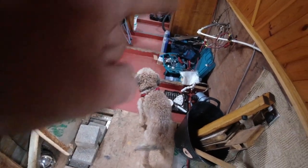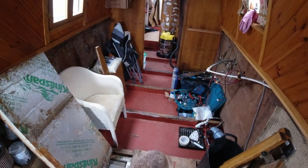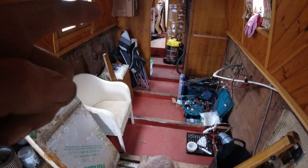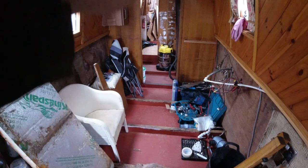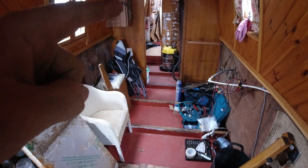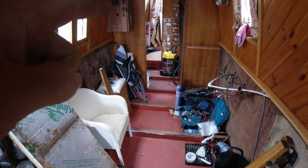All the way out, and then I'll have the air sucking in from the front and blowing out in the shower, because the shower room is going to be constantly moist. So that's the exit I want. So I want the air to come through and then out. And then what I might do is have an extractor fan in the bathroom above the shower.